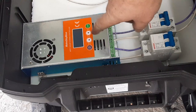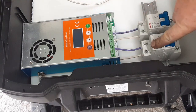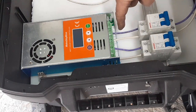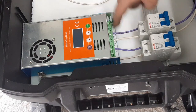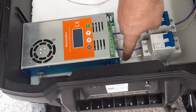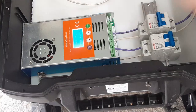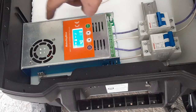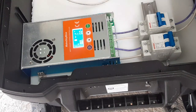Battery is connected and we're ready to test. Whenever you power up a charge controller you always connect batteries first, solar panels second — if you do it the other way you can damage it; it's usually in the instructions. Double-checking wiring: negative to BT negative, positive to BT positive. PV is your photovoltaic panel connection. Flip the switch on and it powers up. These are automatic charge controllers that can detect 12, 24, 36, and 48 volt battery packs.